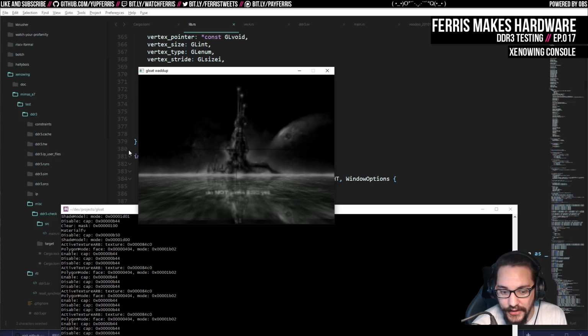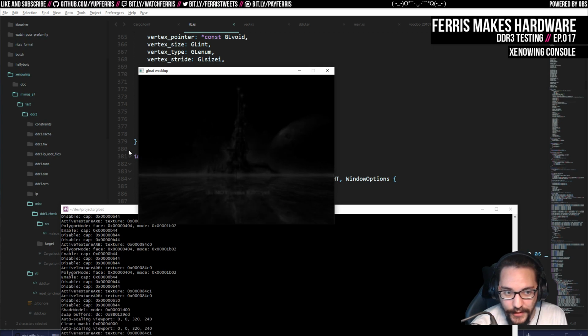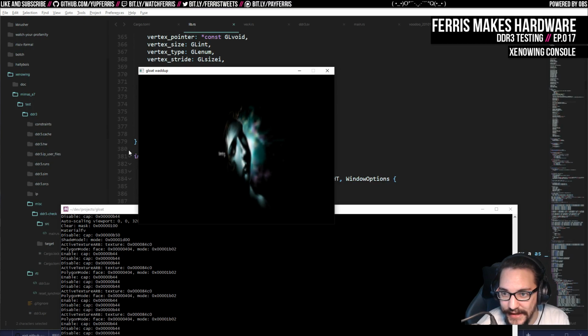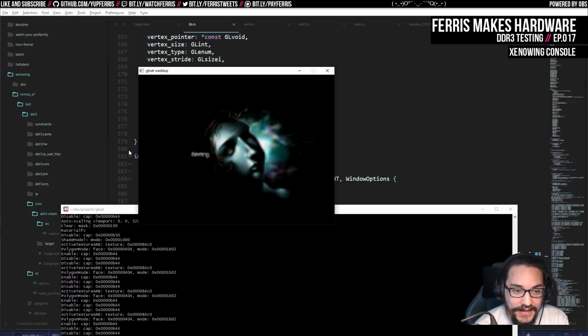But I think it could run as long as I hook up to the FPGA via UART and just move all the data in and out. So it'll use the same rasterizer. So essentially just using the FPGA as a GPU and streaming data to and from that instead of doing it all in software. So I think that's like my next big goal.